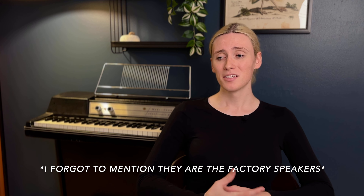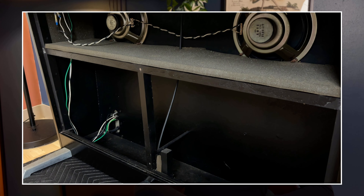A normal 210 would have two speakers in the front and two speakers in the rear; this one only has the two in the rear. Since there are no front speakers on this model, the front kneeboard is all plastic with that black textured paint on it. Now, you might be thinking: what if they just lost the front two speakers, or what if the grill cloth was ruined and they just swapped it out? It's a very good point and a very plausible one. But the two back speakers have the correct ohm ratings equaling to the amp. If there were four speakers in this series and they lost two, those two remaining speakers would not equal what they should have — but these two speakers equal what those four would have been in total. Now we could say they replaced the two back speakers as well, but the dates on the speakers match up to the production time, so they would have had to do that pretty quickly after they got the keyboard. With all that, my friend Steve Espinola from DocWurly.com considers this a late variant 210, considering its two 8-inch speakers and the vertical and horizontal braces that are not found in other console versions.